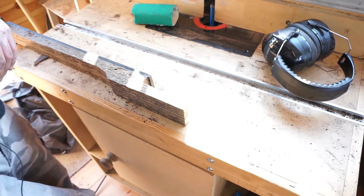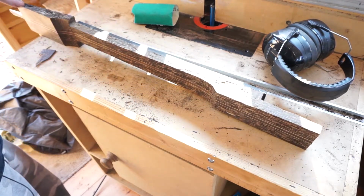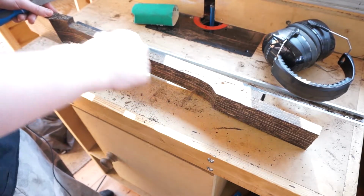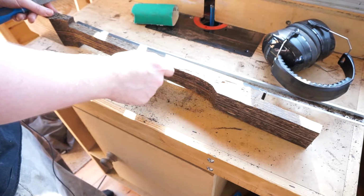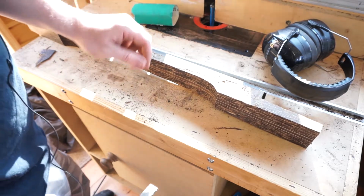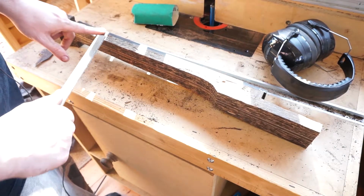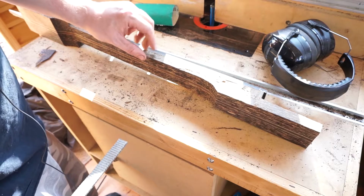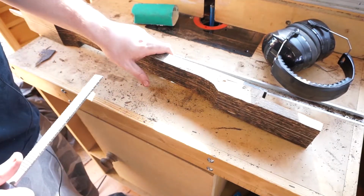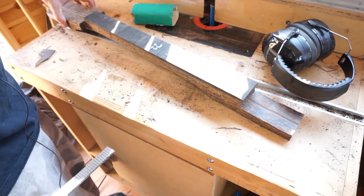So we're suffering the dreaded camera overheat again. So yeah, as I expected, to be honest, this is why palm wood's not really good to use. It's because it's just so prone to tear out. The majority of what we see there will be carved off as part of the neck shaping process, and I'm planning to do that by sanding, basically, just to minimize the tear out. But there are definitely going to be instances along here close to the fretboard that we're not going to be able to avoid putting some kind of filler in. But not to worry, I was expecting that. It's still pretty cool to get something that's starting to look like a guitar neck now.